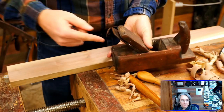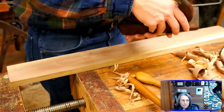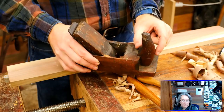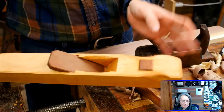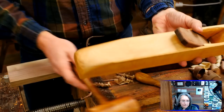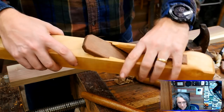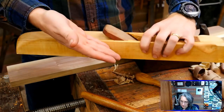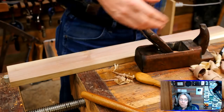You drive it in by hitting the wedge, and retract it by hitting the back. You can also hit the front if you have a Western-style plane that doesn't have the horn — there's often a button on the front of harder wood. On my low-angle jointer I put a button up front, so I can either tap the back of the iron to eject the blade, or tap right on the nose button. Basically you're driving the body of the plane down while the iron stays in place, which backs the iron up. So you'll often see buttons on Western-style planes. I have a whole series on how to make this low-angle jointer.